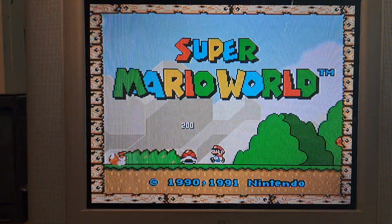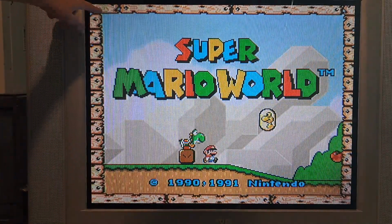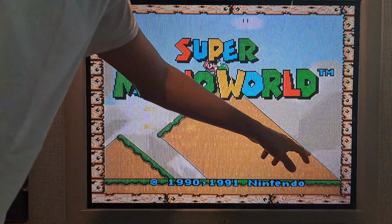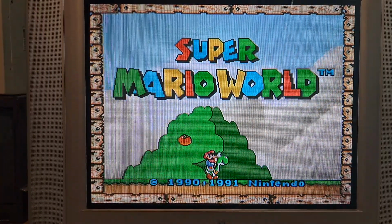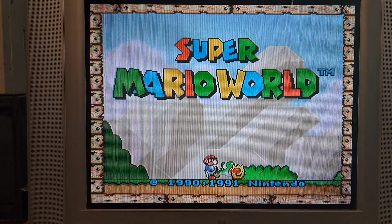In fact, you know, there's not too much blurriness on the corners. There's not too much misconvergence either that you can really notice. If you look really closely in between the lines, yes, you can see a little bit. But honestly, because of how thin these scan line gaps are, it's not super bad. All you really want to make sure is that there's not really much purity issues.